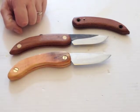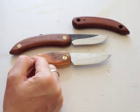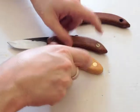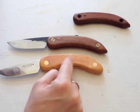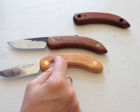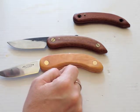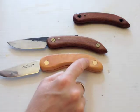On the first video, the wood looked very orangey. I'd only just beeswaxed it when I took the photographs. After about 24 hours, as the beeswax soaked in, the colour softened quite a bit. And in real life now, rather than being orangey, it's a bit more peachy coloured. The orange hue has softened and there's a little bit more pink in it. You can see some of the coarse scratches from the, I think it was 36 grit glass paper that I started working with.